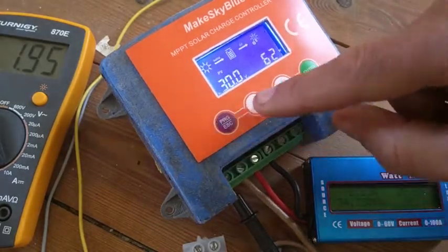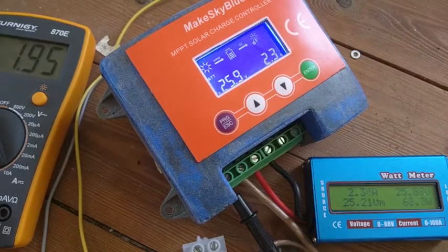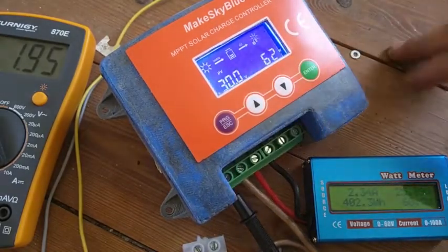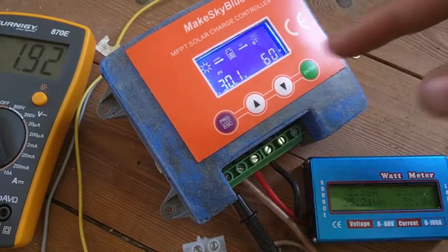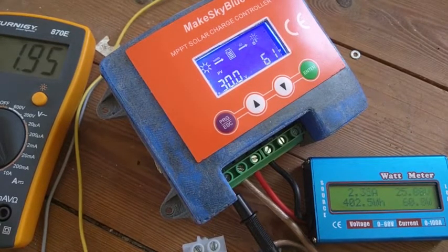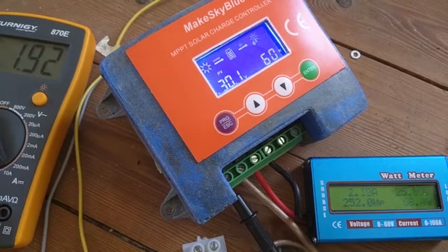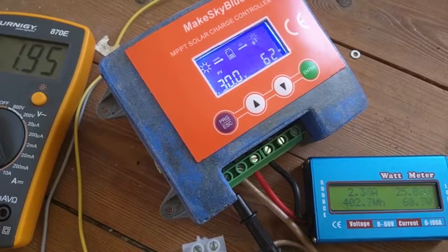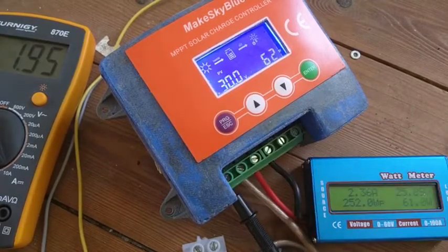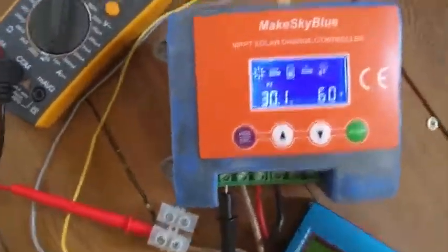The first settings concern the end voltage. The battery voltage right now is 25.9 volts, so it shouldn't cut off. If it did cut off I suppose it would shift the MPPT point to maybe 32 or 33 volts, thereby reducing power. Perhaps it's already lowering the charging voltage because it thinks the battery is full — but it isn't. Right now this unit is not working properly, and again: if you simply shortcut it, it makes more power. So I have no use for this one.